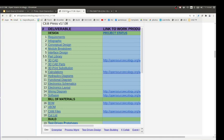Except maybe, like, if you've got super, super fast motion, like, you got so much fluid, like, maybe, like, 100 horsepower. Typically, you run it on one, like, 25 or 50 horsepower, but if you have even more, that means the velocity of that cylinder is going to be, like, way high, in which case, that time, in terms of how quickly the solenoid closes, which is about 50 milliseconds, it's a fraction of a second. But if you're going super fast, that may mean like a half inch difference where the cylinder ends up.